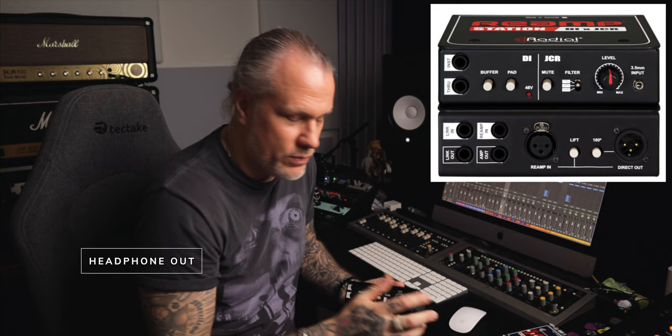And then this has a 3.5 millimeter input too, so you can reamp stuff directly from, let's say, your MacBooks or whatever laptops, speaker jack out, which this is more designed for, but you can do it with this too. In the back, you have amplifier out, link out, so you can link several devices. Let's say if you want to reamp multiple amps at the same time, you can stack these and link these, one signal out from the DAW going into multiple places. And then the reamp in, there's a TRS cable and XLR cable options. So this comes from your DAW and so on.